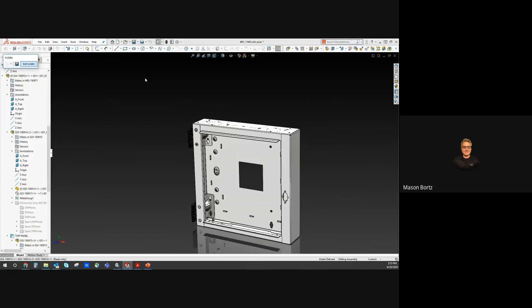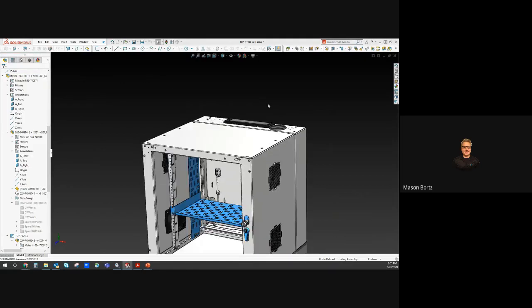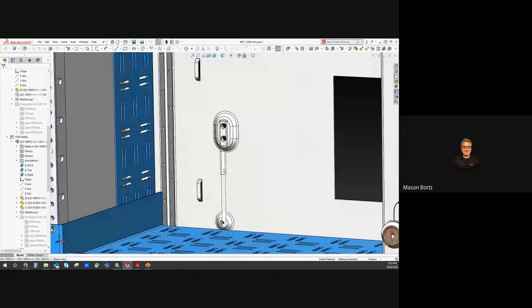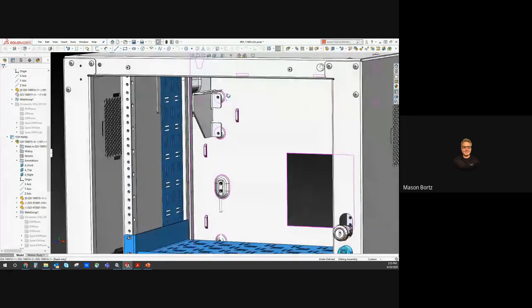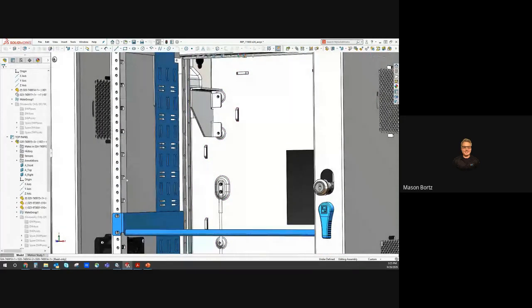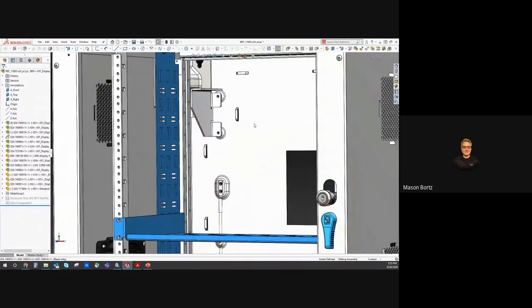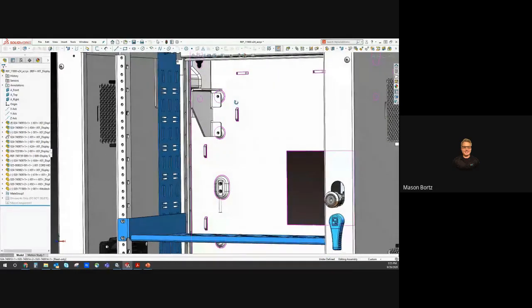So one thing that we've done with the back pan is you can get a 2U right angle bracket. That's shown there in the model. We had a customer who wanted a cabinet that wasn't very deep, so we went with the 18-inch, but then we needed a spot to mount a 2U network video recorder. So we got those brackets, screwed them in the back, and the server mounted back there. It was in a locked cabinet. We were able to bring all of our cabling in and have everything terminate in the rack normally. But when you open it up, the server was in the back there. It's a great solution for that problem, and I know we're going to use it again.